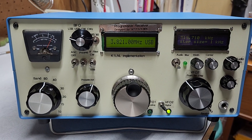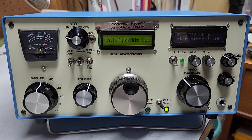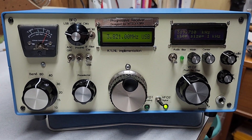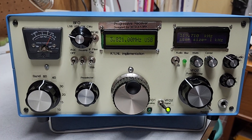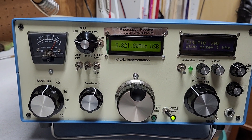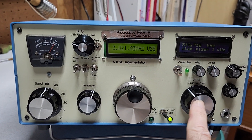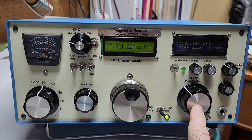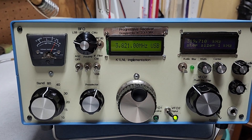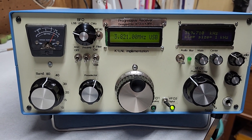The S-meter is one I got from Surplus Sales in Nebraska, and it meets the specs of the S-meter driver I found on Wes Hayward's website, w7zoi.net. That's working very well, especially on the analog VFO. The digital VFO doesn't move the S-meter as much, but the analog one does — especially on code, especially with the timing capacitor changed down to 0.2 microfarad.